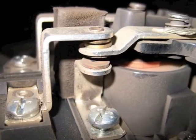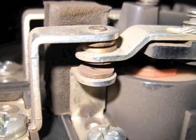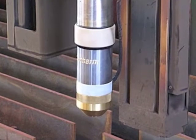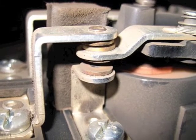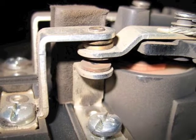A second important component is the pilot arc relay. The pilot arc takes the return power from the torch to complete the circuit. Every time the torch is asked to fire, the pilot arc is activated. It is also included in the annual preventative maintenance package and is replaced during the second biannual service as well.